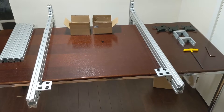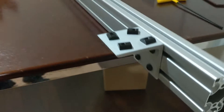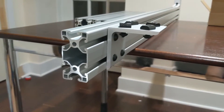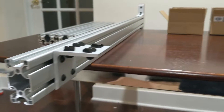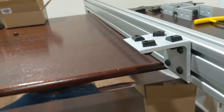I've placed the vertical sections flat on the table so it's easier to attach the brackets. I've attached a four-by-four bracket, put in the screws and nuts, and slid it in. I did the same on the other side, and now it's ready for me to slide the vertical section on top. Let's do that now.